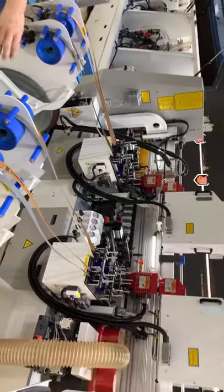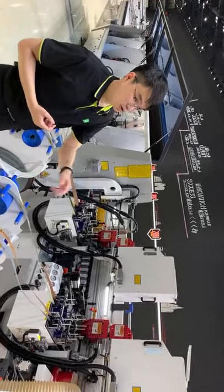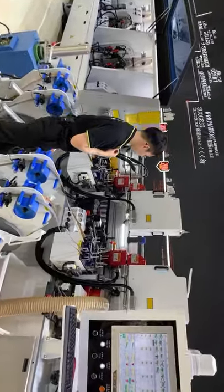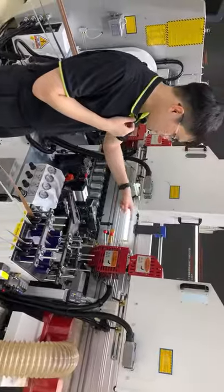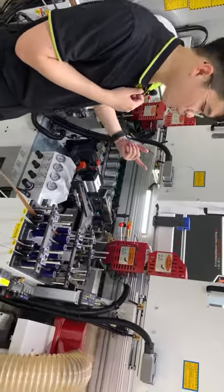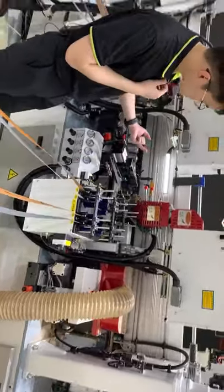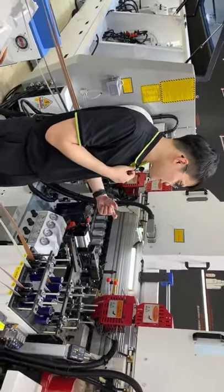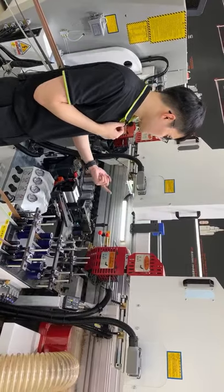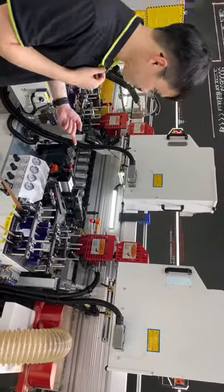The four x-change systems make it easy to switch — just a quick selection on the supervisor screen or the PC. For the glue application, we use a 50mm glue roller replacing the old style. The old type was 35mm diameter, but the new one is 50mm. The bigger roller provides a better glue result, enabling a throughput of up to 38 meters per minute.